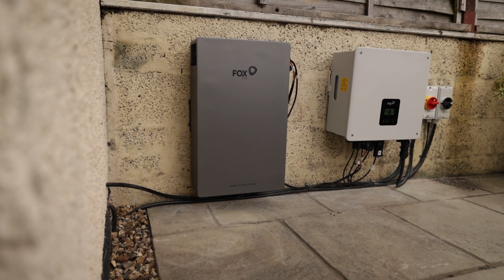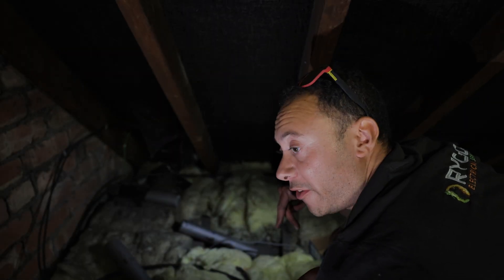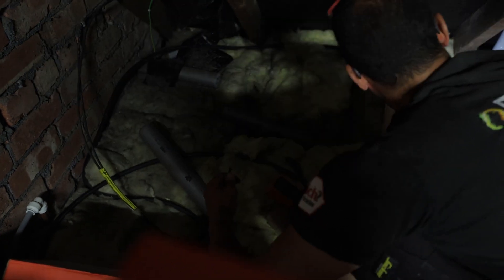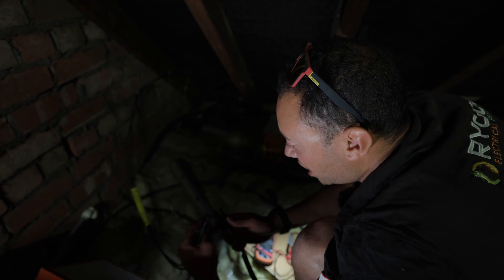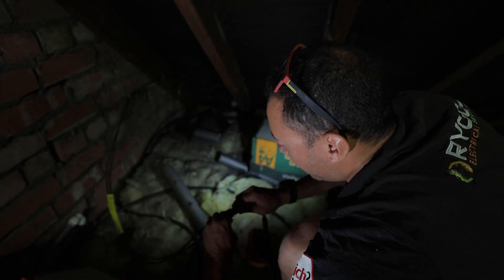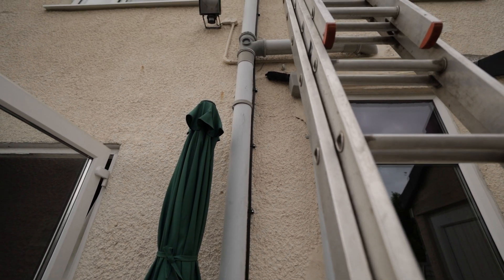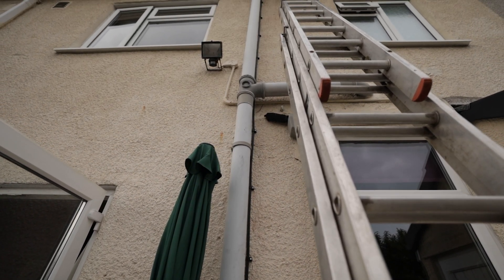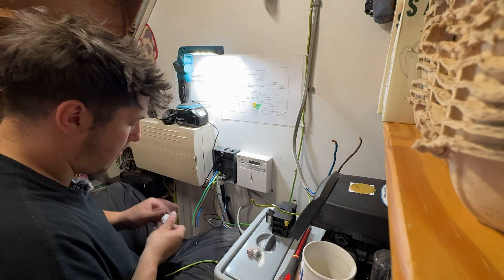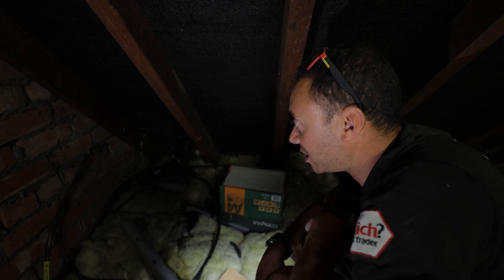I'm doing the final test on the cabling — the solar PV cable from the inverter comes up into the loft, these are the cables that have come off the roof from the existing solar. I've checked for polarity, made sure everything is okay, and now I'm clipping them together. This completes the circuit of the existing solar system on the roof feeding power down to the DC disconnector by the inverter in the garden. Ben is doing the final bits; then we'll do commissioning checks, testing, and get the certification done for building control.